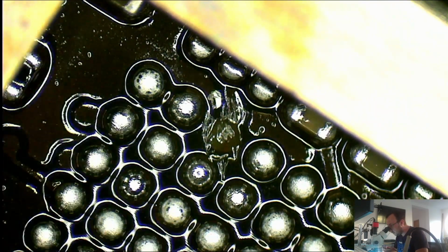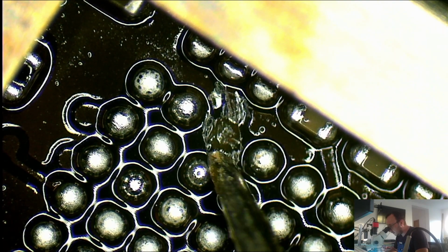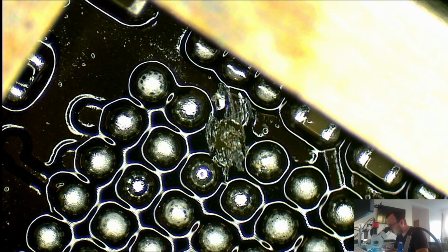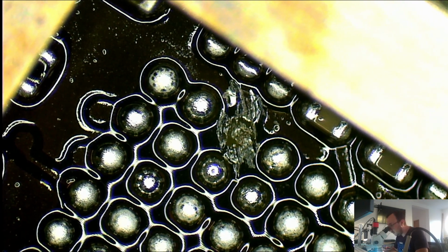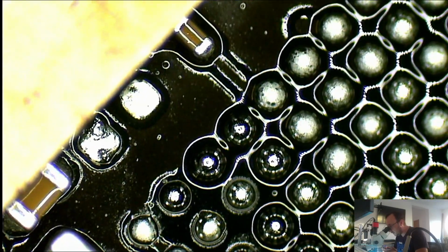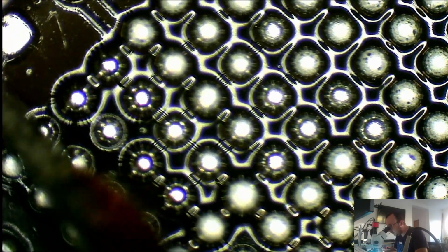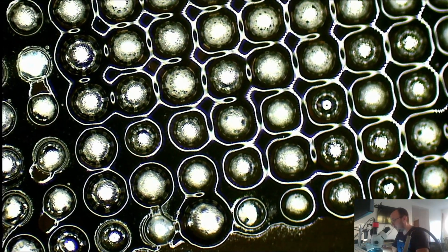So there's a resistor there in the back, and it has a trace that comes to this pad. So this one shears because the board is flexing. The phone is micro flexing every time you put it in the pocket or whatever. So this is a common fault. You can search for audio IC failure on iPhone 7s. I'm not sure if there's something missing there, but let's check now if we still have a short.